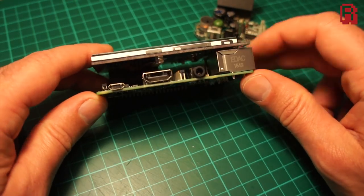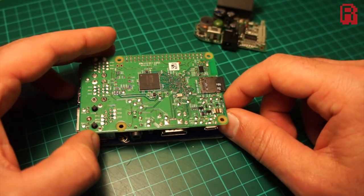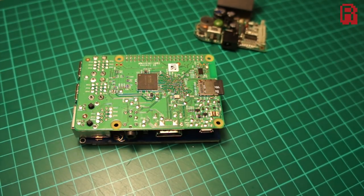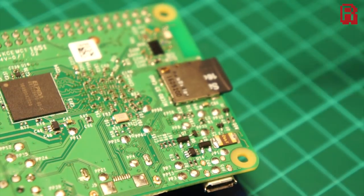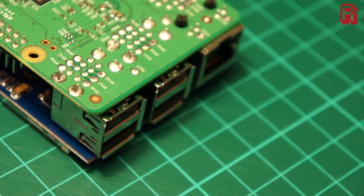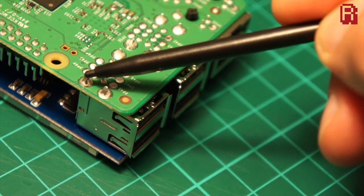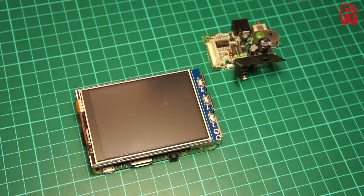5 volt and a ground needs to be channeled into the Pi. Usually it would go in through the mini USB connector, but on the back of the Pi is the PP1 point and we can solder directly onto that to give the 5 volt input. Do double check the Raspberry Pi schematics to make sure you've got the right point. You can also use PP2 but PP1 seems more accessible. Spinning the Pi around, we need a ground point and I'm going to piggyback off the solder point used by the USB ports for ground — it's a nice big bit of solder that's easy to attach to. To make use of that second 5 volt output from the power board, I'm going to wire that directly to the sound board, doing away with the test cable from my previous video.